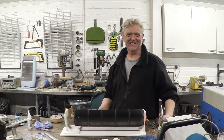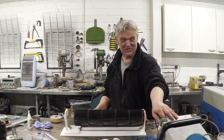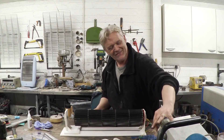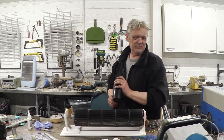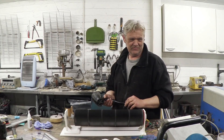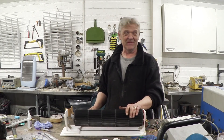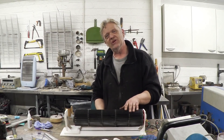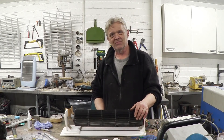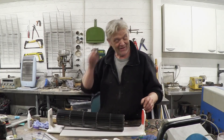Okay, that was stunningly disappointing. It's got a bunch of magnets on it and we're reading about a millivolt — which is just embarrassing really. Checking the current, it's about half a milliamp. I have to say that was not particularly impressive. It could be loads of things: it's a single coil, fairly thick wire so there aren't many turns on it, et cetera.